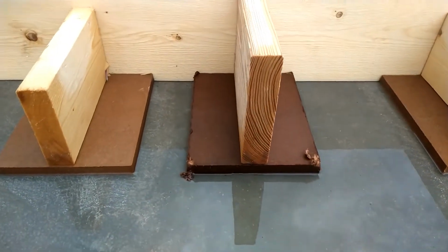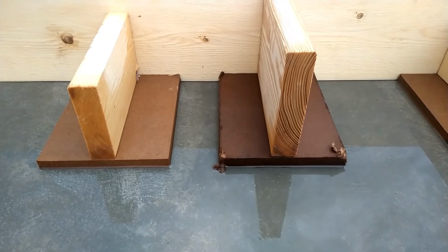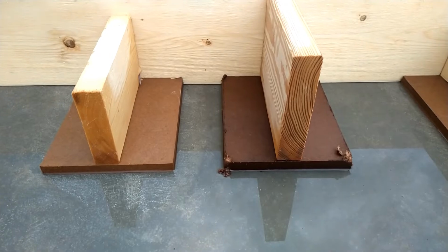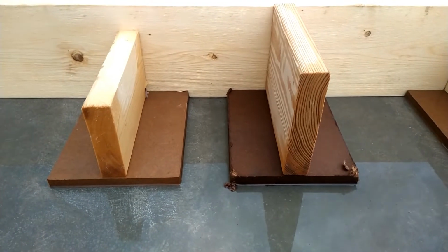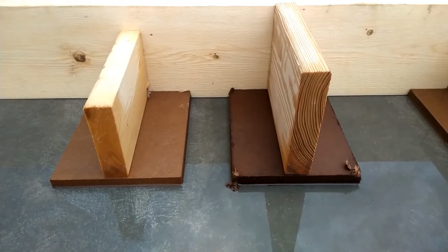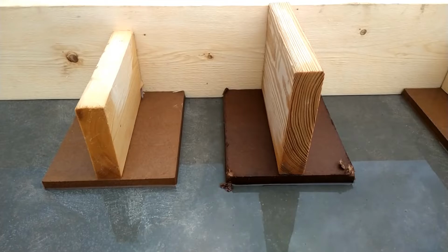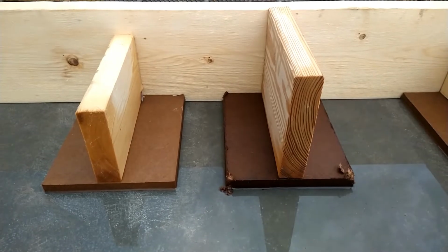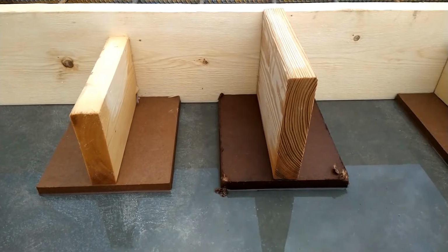Why that is important in the adhesive world, whenever you're bonding materials as a surface slab, is because the material on the right is going to expand and change its shape as it's drying. That puts stress on the adhesive, and the adhesive eventually will let go. And the contractor is going to be very unhappy because everything they glued down, all these kickers, are going to be coming off on them.